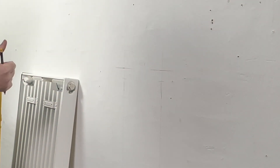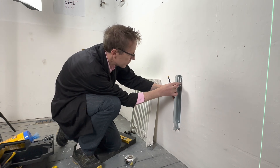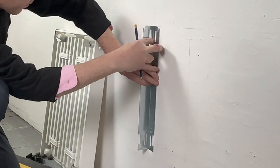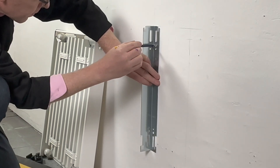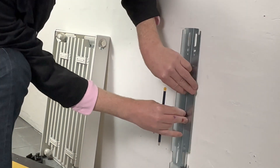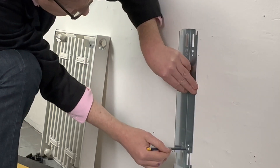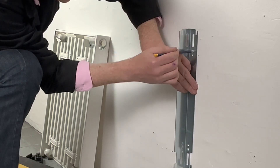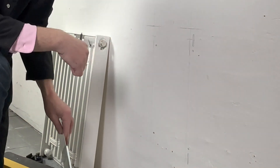Place the bracket in position here like this, then place the other bracket in position and mark out the holes. Some plumbers like to mark out the second bracket so they can adjust it later. We've now marked out one, two, three, four, five, six holes. Let's install the brackets.